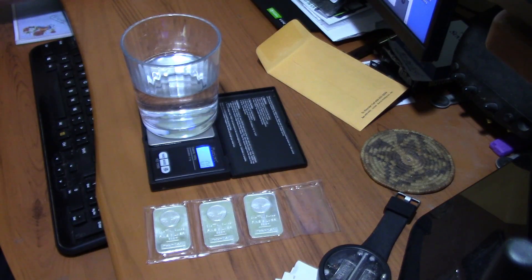That is an easy and inexpensive way to test your silver bars. You can also test your one ounce silver coins using the exact same method, and you can test your gold too — you just have to look up what the density is. Silver density on this scale usually falls around 10.36 to 10.42 for any one ounce silver coins or bars. Silver is falling right now so it's a great time to go out and buy. Thanks for watching and we'll catch you next time.